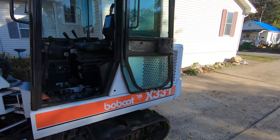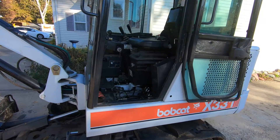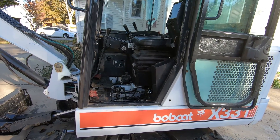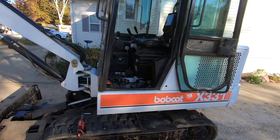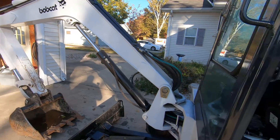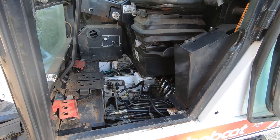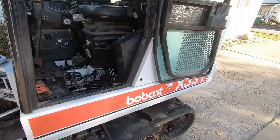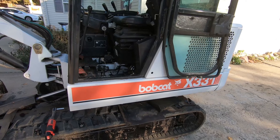What we're doing today is a buddy of mine bought this 331 Bobcat excavator, it's a '95, and somebody has switched the pattern on it — the previous owner switched to CAT controls. Him, much like me, doesn't run machines that way. On these, there's no switch to just change the pattern, so we've got to find the hoses they switched on the pilot lines. There should be two of them — one is your lift and the other is your crowd — and we're going to switch those back. Couldn't find much information on this other than people saying you've got to trace everything down and change the hoses. Bobcats are set up with John Deere-style controls, so we're going to track them down and show you exactly which ones to switch.